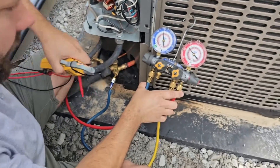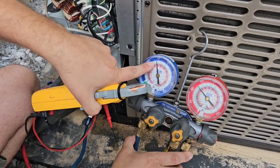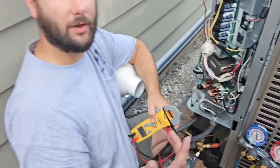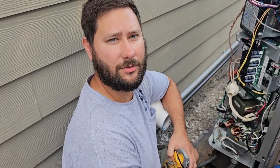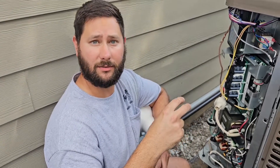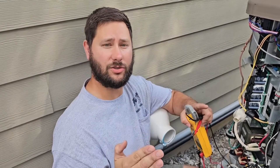You're going to measure your pressure down here. The pressure is 140 PSI. So you take 2.6 volts, which is the output of the transducer, and then you take 140, and then you look at a chart. You can get that chart through HVAC Navigator at upg.net. You look at the output voltage — 2.6 for the suction pressure transducer — and the pressure of 140, and those two should correspond.